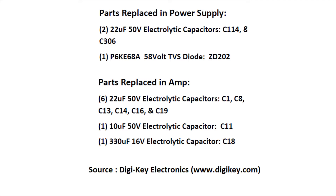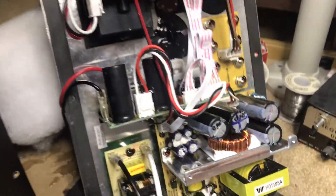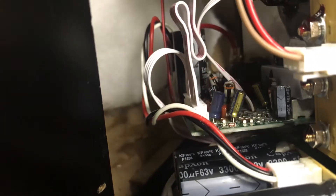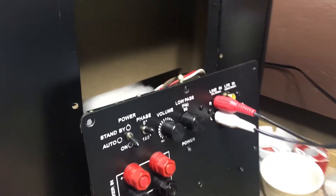Here's a summary of what I found bad: 10 caps and one TVS/Zener diode. I ordered the parts and put them in. I did want to mention that replacing some of these caps was a bit tricky because the holes are plated-through, and getting the solder to flow out easily is kind of hard. If you're having difficulty removing old solder, try adding some new solder to the joint first. Everything is wired back together with an audio source connected — let's see what happens.